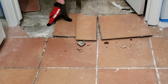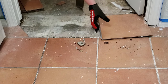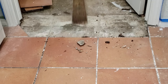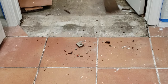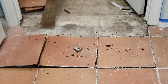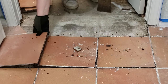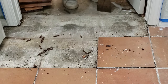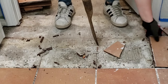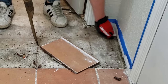You can see that with enough force the tile should pop up really easily. After you break loose that first row of tiles, pick them up and start a stack somewhere out of your way, then continue using your floor scraper to break the ceramic tiles loose from the concrete. If you run into a tile that won't break free after hitting it from the side two or three times, go ahead and break it from the top.